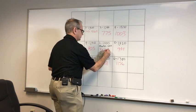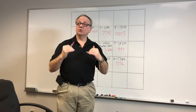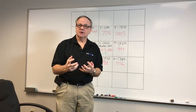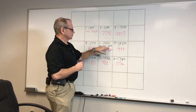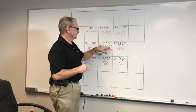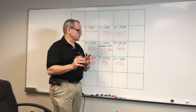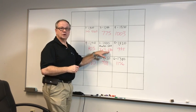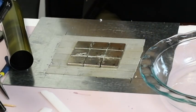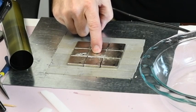The magnet started at 1400 Gauss on its own. When mounted on VHB tape with steel backing, it boosted to 1828 Gauss despite the slight air gap added by the tape. Then, after placing surrounding magnets to form the 3x3 grid, it dropped all the way down to 630 Gauss on the center magnet. When we look at the center of this array, the center Gauss reading is 690.